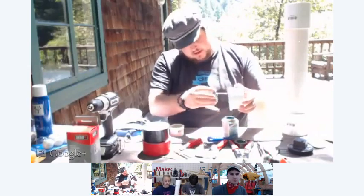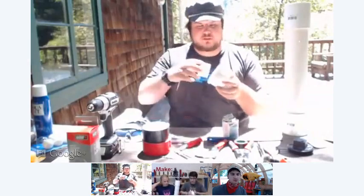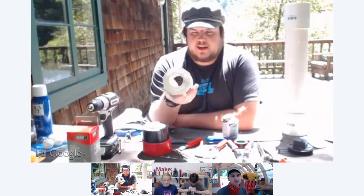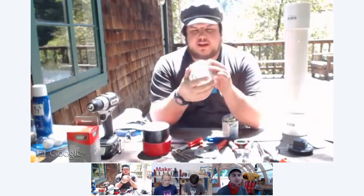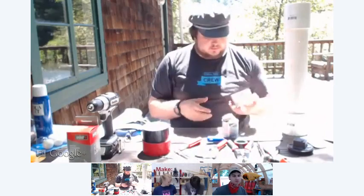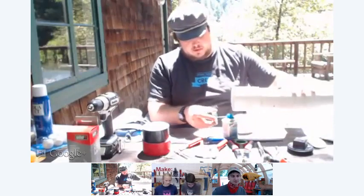Okay. But what you're looking for is a 3-1.5-inch reduction. Okay, and why are we choosing the 1.5-inch reduction? Is that the size we need for the ping pong balls? That's our barrel. A 1.5-inch PVC pipe, Schedule 40, is just the right size for a ping pong ball. Okay. All right. I'm going to apply a little bit of glue.